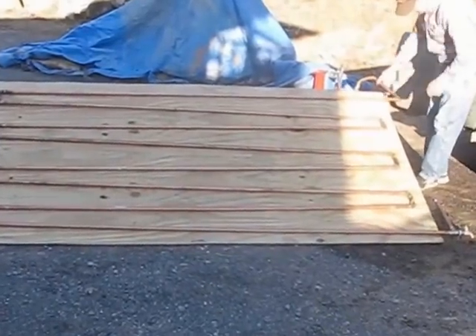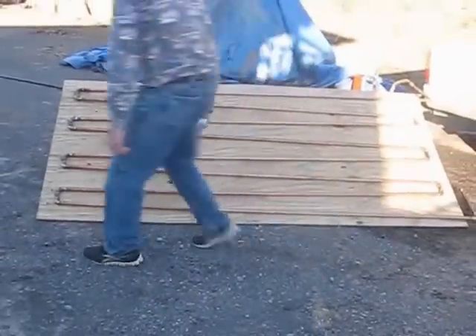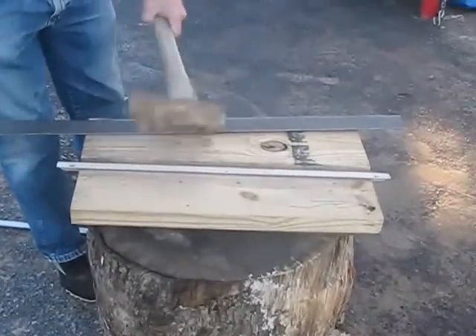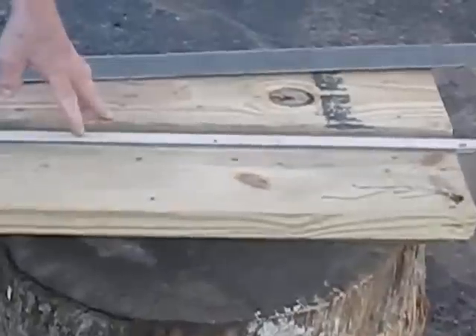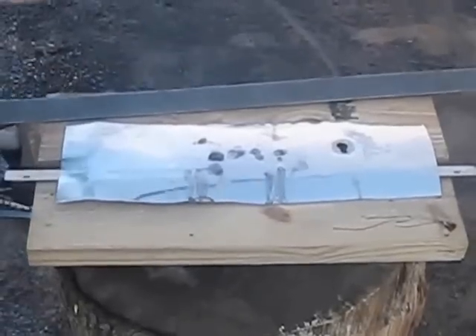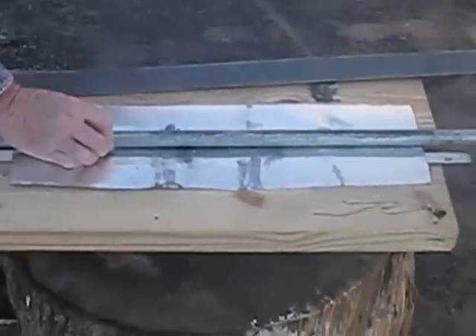Checking for leaks now, making sure we have no leaks in the joint. What you do is take some 2x6's and 2x4's, put them down with about three-quarters of an inch spacing for the three-quarter-inch copper tubing. That's about what you need. Lay your fin down in the center of it, then lay your metal pipe on top.